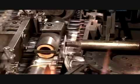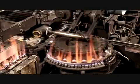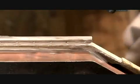At the start of the mount line, a machine cuts glass tubing into pieces of specific lengths. The cut tubes land on what's called a glazing wheel that runs them through a gas flame for about 7 seconds. This heats the glass enough to smooth the surface.